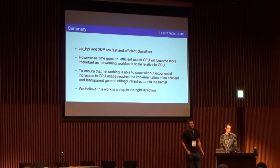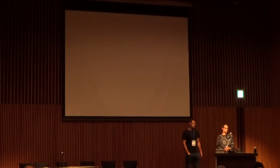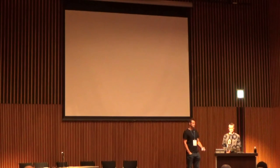Okay, you said that you prepared this metadata before the packet, but I also understand that you need to leave some headroom. So do you leave the headroom and put the metadata before that? Yeah, so we had that designed into the receive path for a long time. There's information in the descriptor that tells you how much metadata is prepended, and the firmware is telling the driver what's the maximum size of the metadata that can be prepended, and then you can adjust your Rx buffers so that you can always have the space for it, on the driver side, to be ready for it.